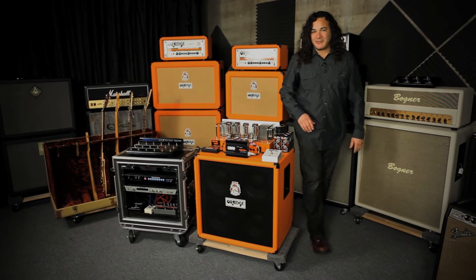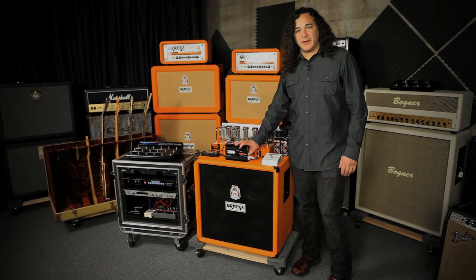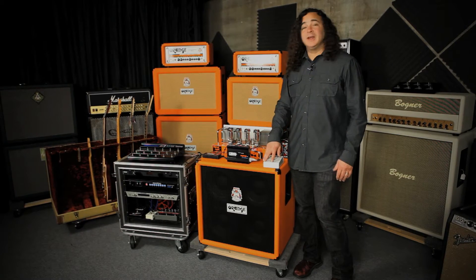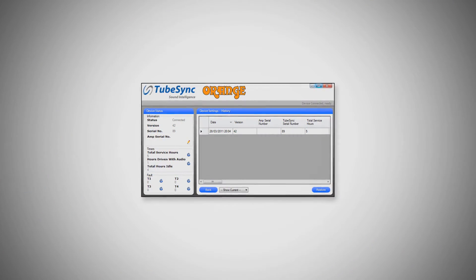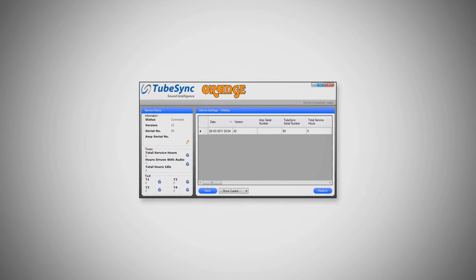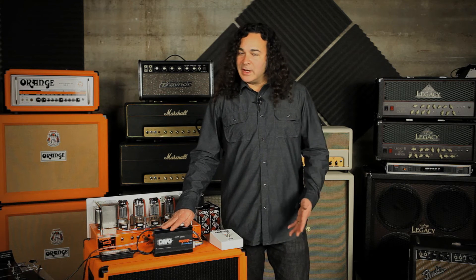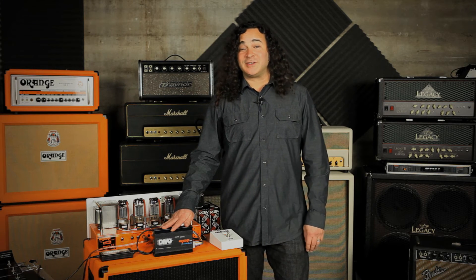If you're a big fan of running your amp at half-power, there's another function you're going to want to know about. This switch is called Share the Wear, and basically means every time you fire up your amp, it's going to alternate between which pair of tubes it fires up on. Bias Runner also features a very cool history pane that documents every time you set up an OV-4 with the same or a different amplifier, including what biases you're using. You can add a comments window for what tubes you were using — all sorts of stuff. That's really useful for a busy tech making changes on your amp.